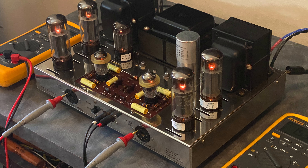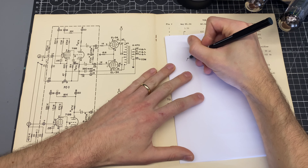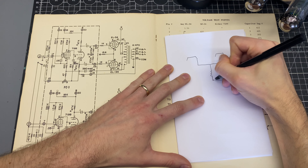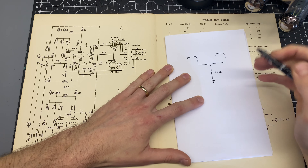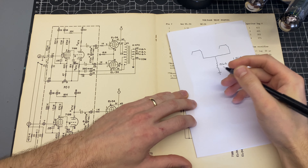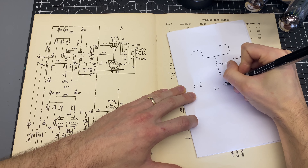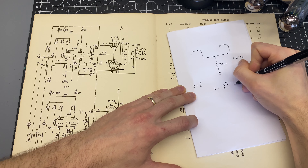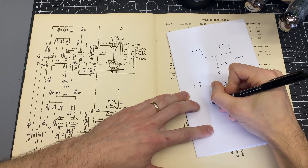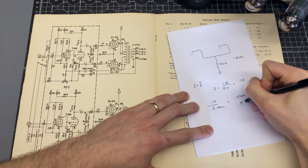The area of interest is the cathode circuit in the output section. This is push-pull EL34, and the cathodes of both output tubes are tied together, then travel through a 15.6 ohm resistor before going to ground. On the front of the stock ST70, where it says 1.56 volts, you're measuring between ground and one side of the resistor — so we're measuring the drop across this resistor. Using Ohm's Law, I equals V over R: current equals 1.56 over 15.6, which equals 0.1 amps.